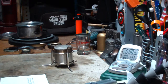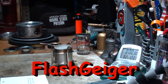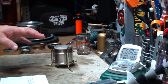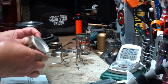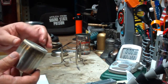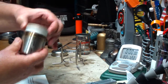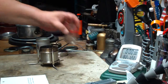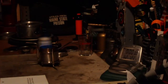I got a really interesting idea from Flash Geiger. Flash Geiger said you could turn off the jets by removing the inner aluminum sleeve, although it would have to be cool first. Maybe without the sleeve, Flash Geiger also said that maybe without this sleeve you wouldn't get enough thermal feedback to keep it burning, but that would be interesting to see. What Flash is talking about is there's a sleeve here that comes out, although I did try to take it out one time with it hot, and wow, it wasn't easy. So that's something you could try, but once it heats up it gets a little sticky. But just to show you, just dump some alcohol in here leaving the sleeve out. When you do that, there's no pressure build up for it to come out the jets, but I just wanted to give you an idea what the flames look like.